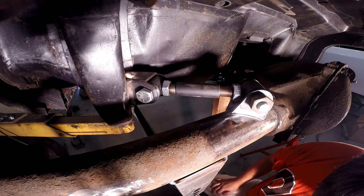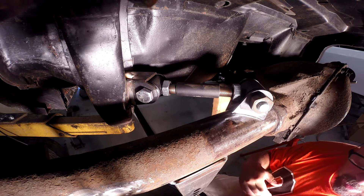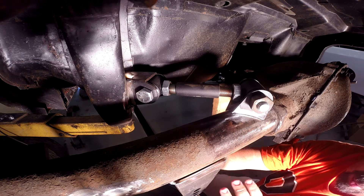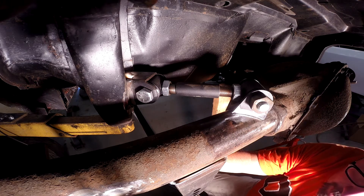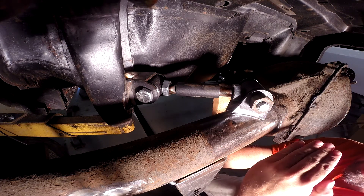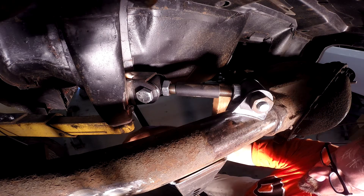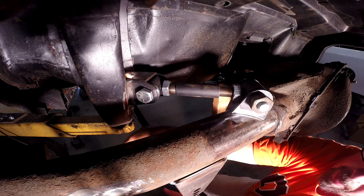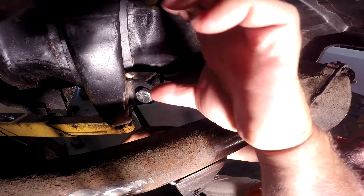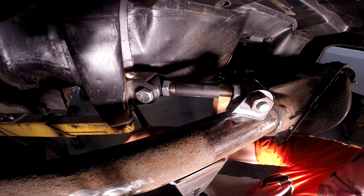You may not be able to tell from the video right now, but we've gone ahead and pulled all the leaf springs off — the traction bars, all that's gone. We've got the rear axle supported on some pipe stands, and they're adjustable. They've got a threaded section on them so I can tilt this rear end however I want. We've got the lower links installed, and we've adjusted these pipe stands so that we're the same distance from the frame rail to the top of the axle.